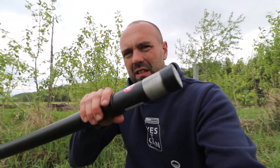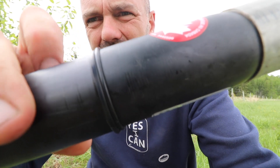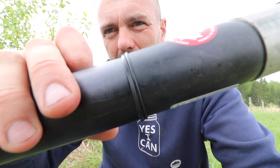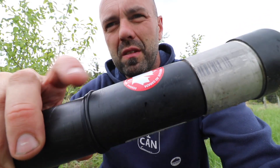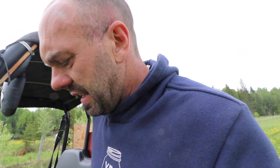This joint's all welded up. You can see the joint — basically the little unit there melts the plastic, and then the metal device pushes it together. It's really cool — that little metal device actually reams the plastic to make sure the joint is perfectly square. Now we'll be able to connect the pump up to this and fill those tanks at the top with creek water if needed, but we're going to try to run the entire thing off spring water. We can use that water for irrigating the garden, hydrating the animals, and we think we'll actually drink it in the house as well.